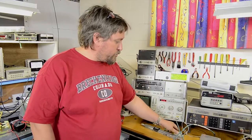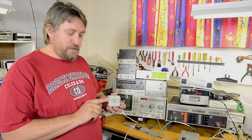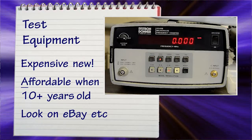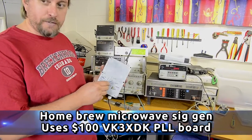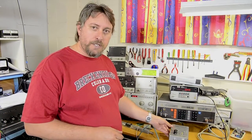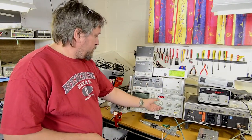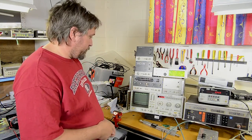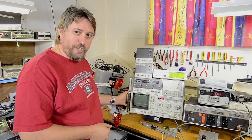There's a signal generator which I use with a comb generator that produces harmonics right up the spectrum — very useful as a signal source. My frequency counter is good for 26 GHz, again not very expensive but picked up in the surplus market — a very useful device. And my portable signal generator, which is not finished yet — I just ordered the VK4GHX design for that, based on the Graham Burns XTK design. At the moment it's putting out a harmonic on 5.7 GHz — a relatively clean signal. Not bad for a harmonic. This instrument is pretty old and I've been trying to baby it; it's pretty expensive to replace.